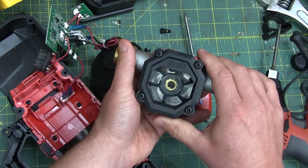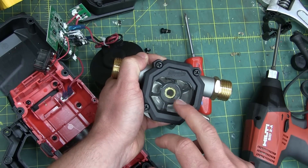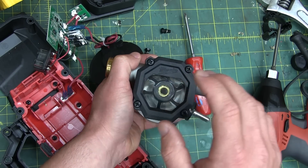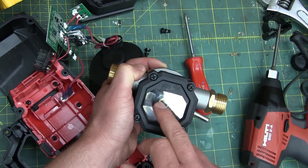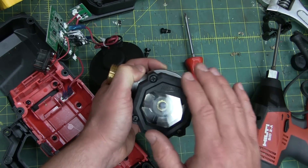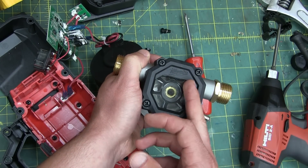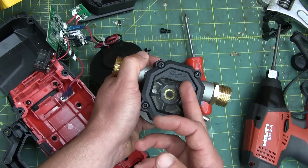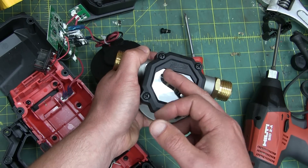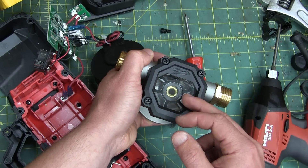Let's get into it. Especially if you're in an abrasive slurry, you'd very likely wear these lobes off. There's an interesting bit about this type of pump: you'll never go over pressure. Even though it's a positive displacement pump, you can never go over pressure because if the pressure exceeds the force required to tilt that vane over further, it just short-circuits — it's like a built-in relief valve.